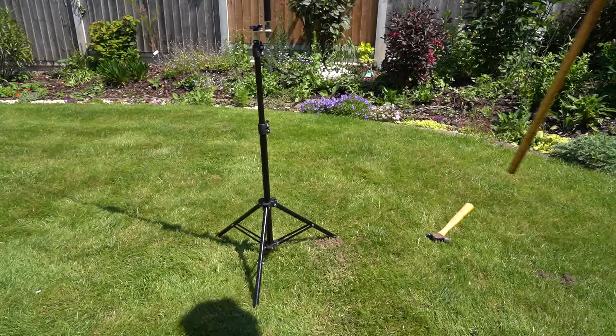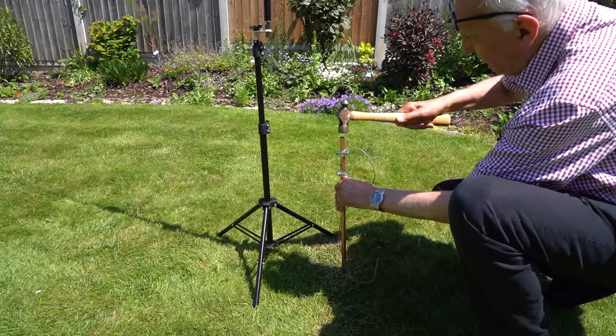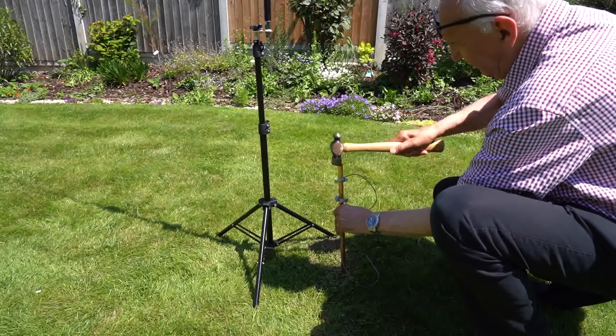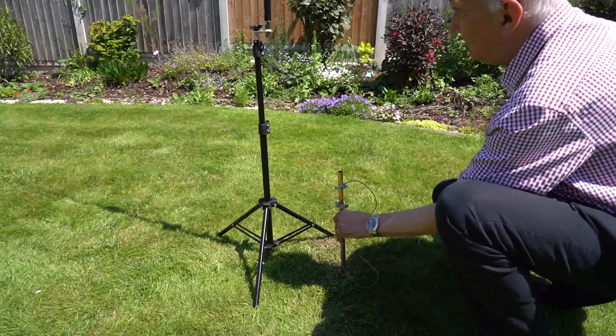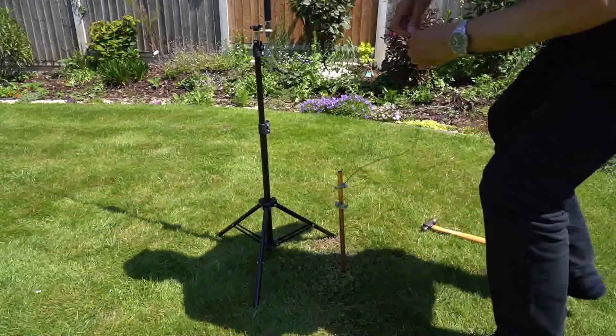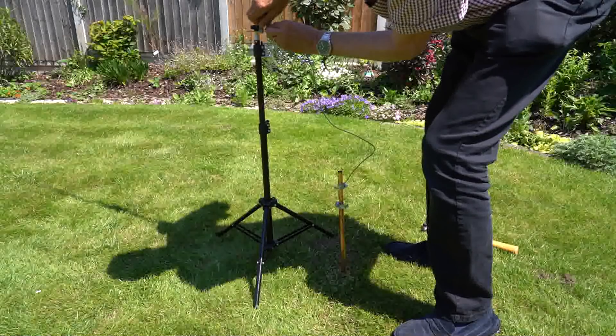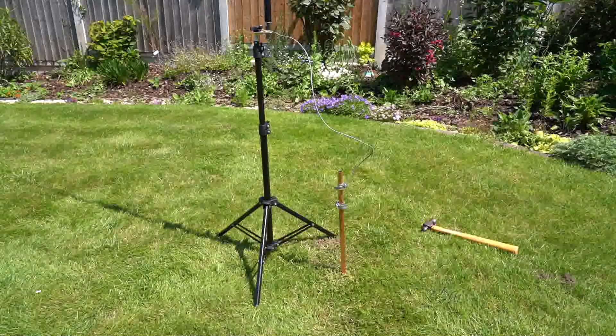So we've now achieved a convenient way of installing the antenna at a set height above ground. Something that is often missed is a direct earth connection. I've found that it gives stability to the matching. All you need is a bit of copper piping from B&Q, a hose clamp, and a length of wire — you clamp the wire onto the copper pipe and the other end goes onto the base of the antenna. And there you are — a direct earth connection. Interestingly, even with that direct earth connection you get a decent VSWR and it does work, but not as good as it does with some radials.